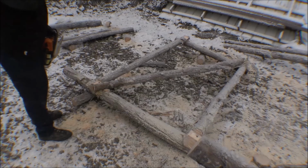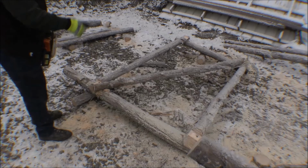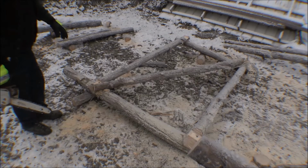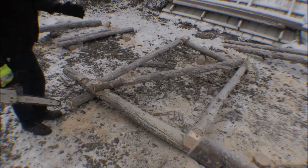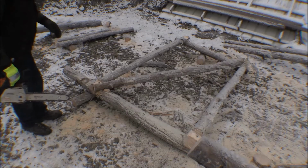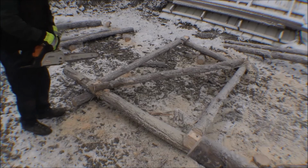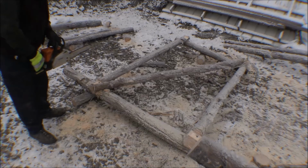By putting that diagonal in there between these two stretchers, you can approximate the angle to get those flush together, but it's not going to be exact because once you cut an angle there, it's going to keep changing a little bit as it goes up against there. So I got a start on it, and now once I got it started and fit it in there, if I just run the saw up and down between the two pieces, I can get it to fit pretty tight.